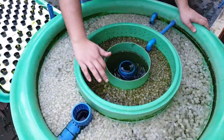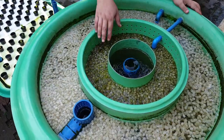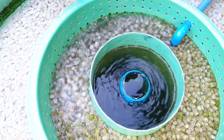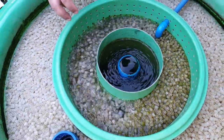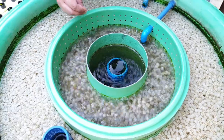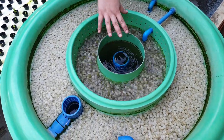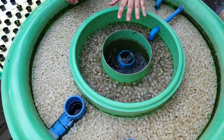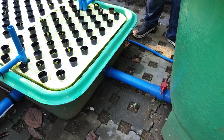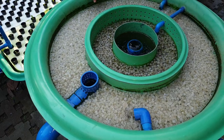From the radial flow, it will exit a static bed over here. It's very easy to maintain our static bed — you simply open a valve, divert the air into the static bed, and let the media churn for 5 to 10 minutes. The churning motion knocks off all the muck and fish solids trapped inside the K1 media, forcing them down to the bottom of our conical bottom fish tank. Then we can open the drain over here for maintenance purposes. We turn it off, transfer the air back to our MBBR, and the cleaning cycle is over. We won't clean it for this video, but we have other videos showing how to clean this filter.